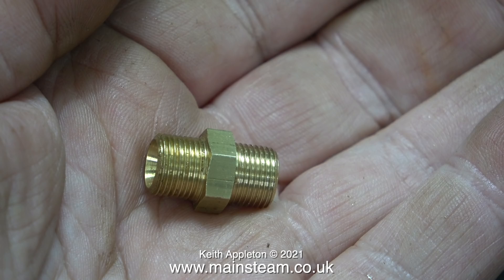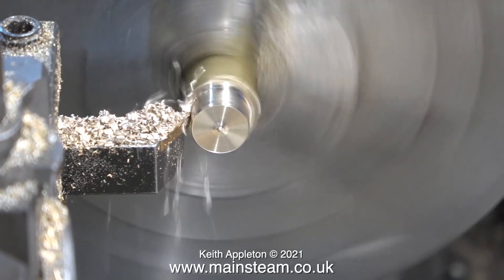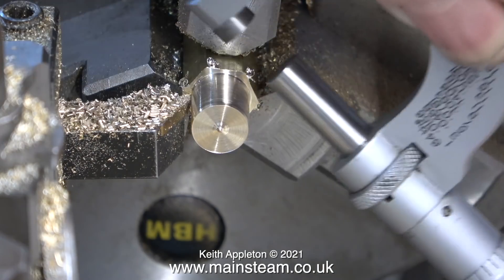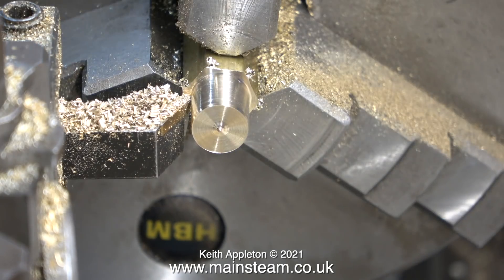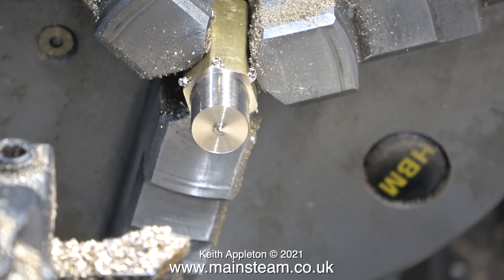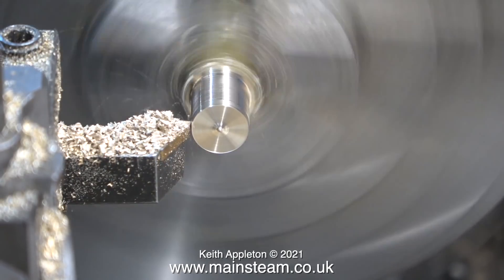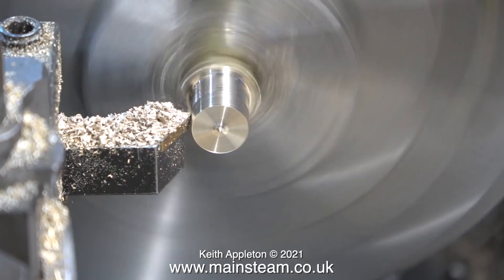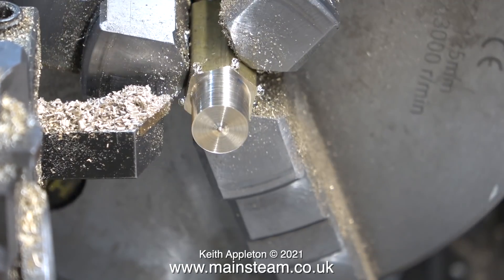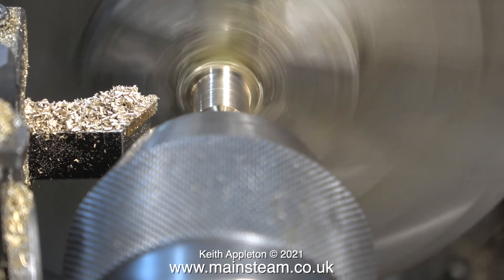This is a commercial union that sits between two union nuts for extending pipes. I've been using this fitting to show the arrangement of the exhaust from inside the condenser to the chimney, but the fitting is too short, so I'm making a new special one that is longer at one end than the other. First I need to turn down a piece of brass hexagon to 3/8 of an inch in diameter — check it with the micrometer and keep removing metal until it's the right size. This is the final cut and it is now exactly 3/8 of an inch. Next, drill down the center using a center drill — this is where the union cone sits so it needs to be quite a deep center.